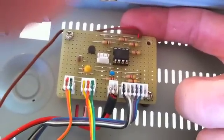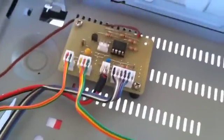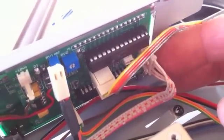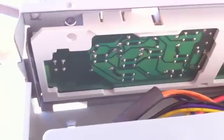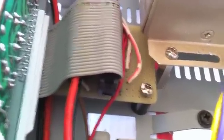I've added one more thing to it here in the back — an output for an LED on the front of the unit. I've also used his optional minor alarm and critical alarm LED outputs on his board, and I've added an LED to monitor the 5-volt power supply. Here's a shot of the back of the switchboard and the LED board.